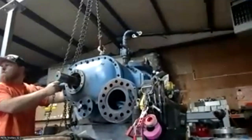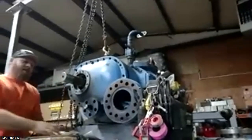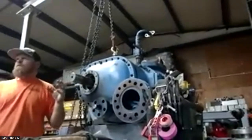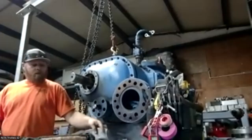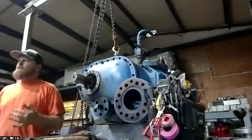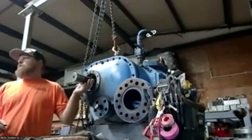That's another question. Can you explain the different types of seal that we normally see? Oh, man. So the older Mycoms just generally ran probably the typical double seal everyone's seen. It's an FES model, probably had a bellows seal. A lot of the newer Mycoms have a Boss seal, BBSE seal. They're just a single seal.